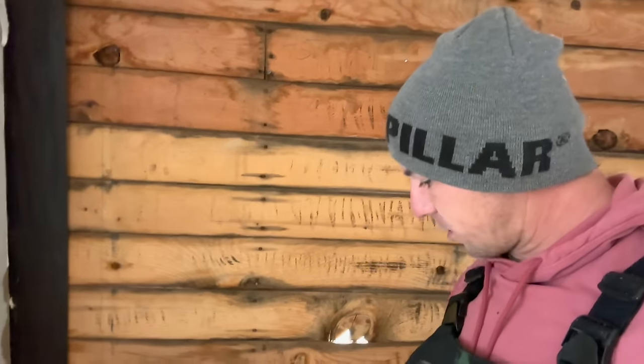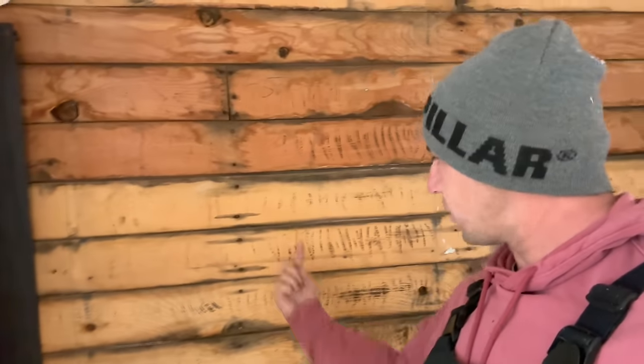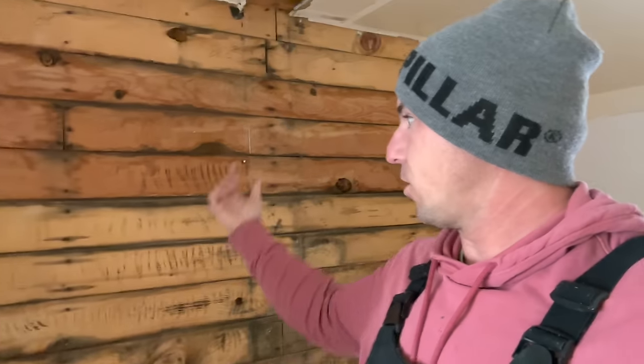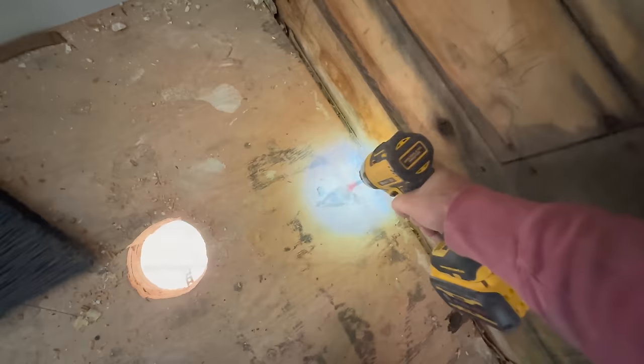So I need to put that line up through here so that it can plumb into the water heater. And then there'll be another line that goes out that is obviously giving out hot water. And then we'll have to run that 3/4 inch line back again for all the hot to go where it needs to go.